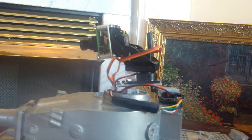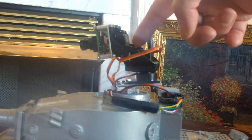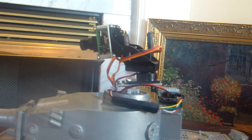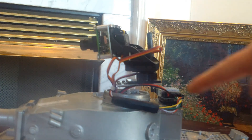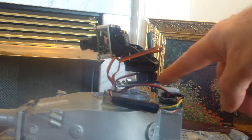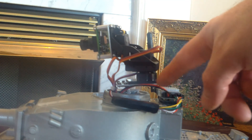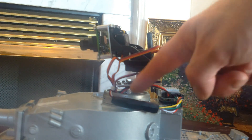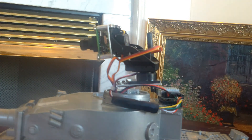You have to add your own servos. I added a regular servo for the tilt part, and the pan part has a 180-degree servo so you can turn at a greater range. The stand for the pan and tilt system I made from scratch — it's a pedestal that goes down into the floor of the hatch and is held by three screws.